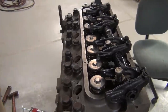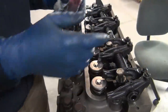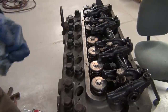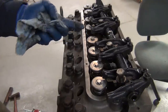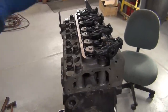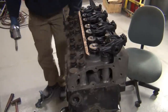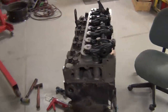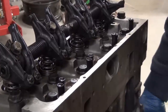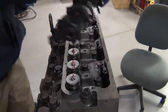I painted myself into a corner a little last night by putting the cylinder head on. I lubed everything up - push rods basically - so I can't just come back out. I'm committed to putting at least a valve train on to hold those in. Before you do anything with the push rods or mount anything, you want to look down the line of push rods and make sure they're all bobbing up and down when you rotate the engine over. We should be seeing every single one of those bobbing up and down.